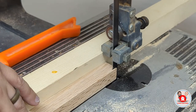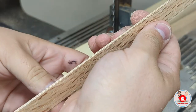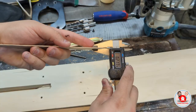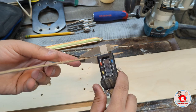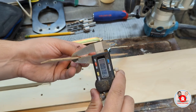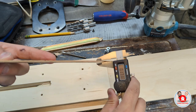Now the only thing left to do is try it out. I cut this very thin piece of oak, and as you can see on the calipers, I did a pretty good job. This really didn't wander very much — everything was within two hundredths of an inch, which in terms of woodworking is about the best we can hope for. I haven't tried to saw anything thinner than a tenth of an inch, but I might in the next couple of days and maybe do a video on some inlay banding. For that, you'll need to like, comment, and subscribe. Catch you next time, YouTube — thanks for watching!